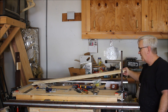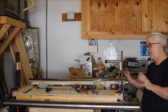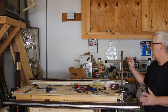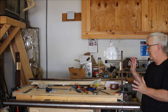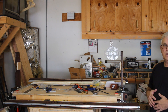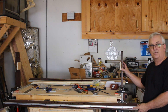Then I'm ready to put the front and the back rail on, and I've got my two pieces — the top and the bottom — cut and ready to go on too. But before you just start slapping stuff on here and screwing it in, I like to build the whole gantry assembly as a dry fit. You can see here I've got lots of clamps laying on the table. So I'm going to clamp this thing together, nudge it back and forth to get everything centered perfectly, exactly the way I want, and then I'll secure the clamps, make sure everything's really snug and not going to move, and then I can put the whole gantry together and start screwing it in permanently. I'm going to try to get this gantry done in this video.